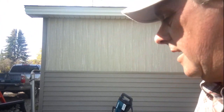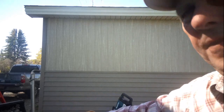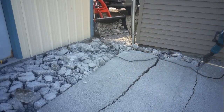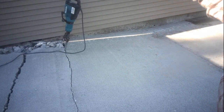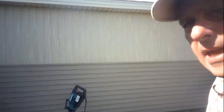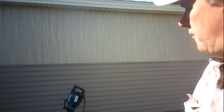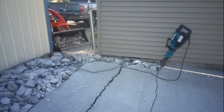Done — literally done both ways. Taking the jackhammer back, I've got enough of the stuff broken out here. This last big piece is going to be easy to snag with the excavator, pick it up, haul it off, maybe drop it and break it a couple of times. Same thing with that one. When I get over to the next big one I can take those and just drop it, beat on it with the excavator, get at the crack, and pull everything out as I go along. That was a workout trying to hold that thing up at the side to break those pieces loose where they were poured into the vent for under the house.